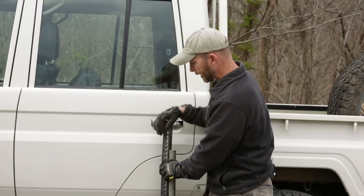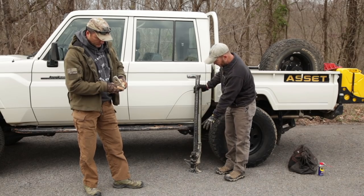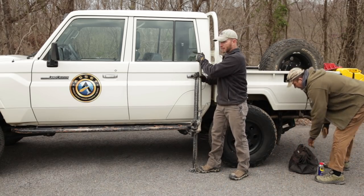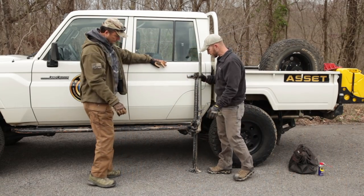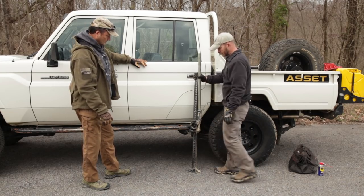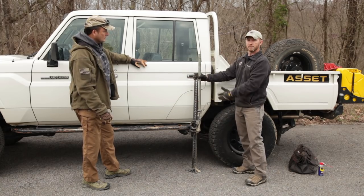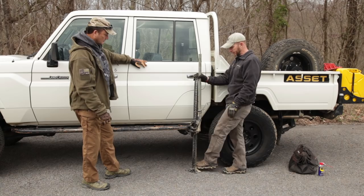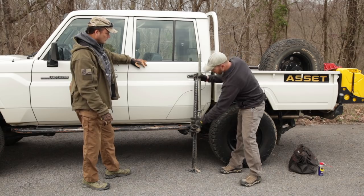Usually use a hand or a rag or t-shirt to protect the body of the vehicle. This is the position the jack should be in as it comes off the vehicle. We'll bring it up into position — this is assuming we find a good lifting point, and there'll be another video that talks about picking a specific lifting point. One key safety point before lifting: look at the shaft from two different 90-degree angles and check that the shaft is plumb — straight up and down — because that base has quite a bit of wobble and if it's not straight it may fall as you lift.